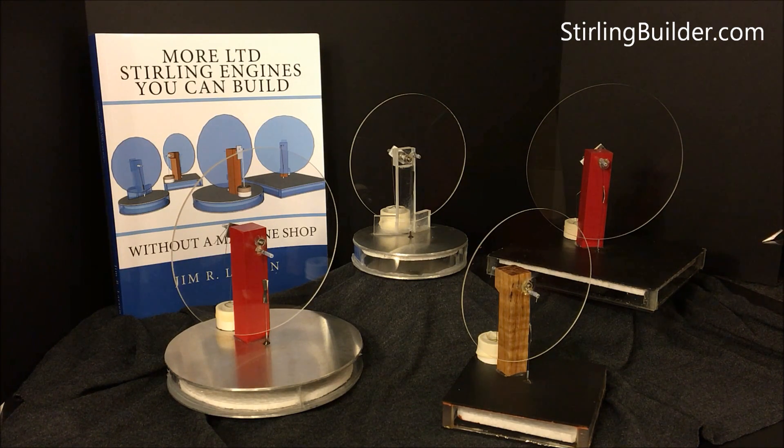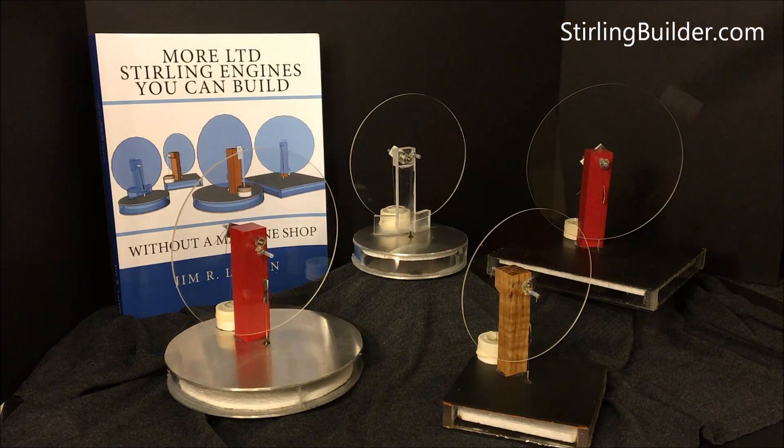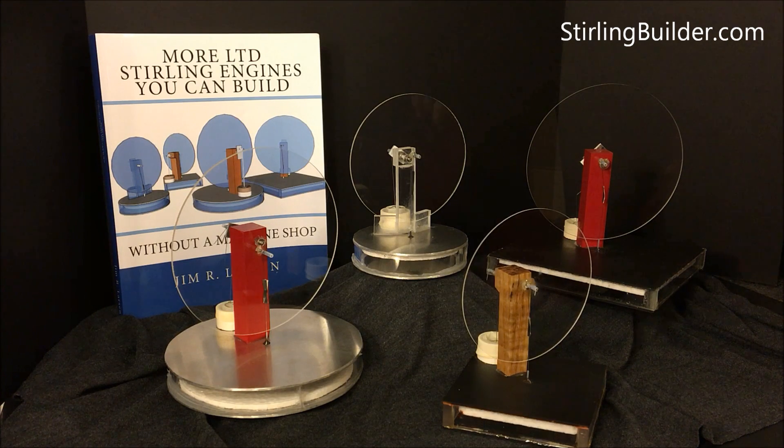In the first book about Stirling engines we overcame friction by changing some of the traditional angles of the flywheel axis and we used a magnetic drive so there were fewer contact moving parts. In this one we've gone back to a traditional design and overcome the friction problem by putting a Teflon bearing — a real simple little Teflon bearing — on the main axle. You can see them out here on each of the drive crankshafts. We talk in the book about where to find that material and how to work with it. If you unload one of these flywheels and give it a spin, it will actually spin under its own inertia for over a minute — so the Teflon bearings are very successful.